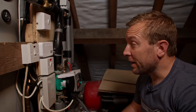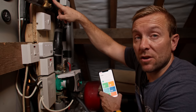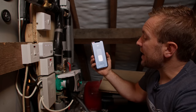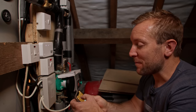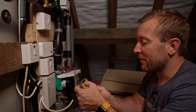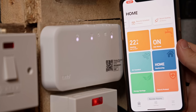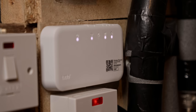Back up in the loft — it was very quick and easy, it pretty much did it all on its own. Currently we've got the hot water on, indicated by the light next to the dripping tap icon. I can also see the two-port valve is open and the pump is running. I tested switching it off from the app — it took about 30 seconds to a minute to register. Everything is working. Now we can install a smart radiator thermostat.